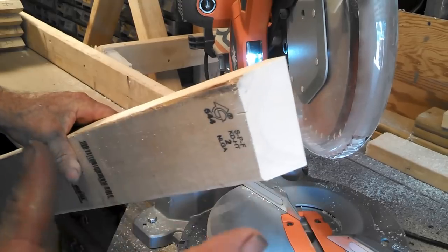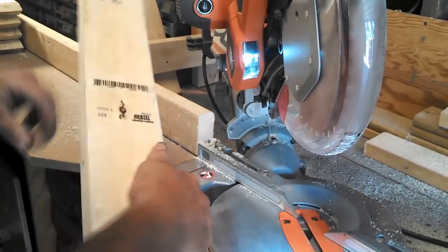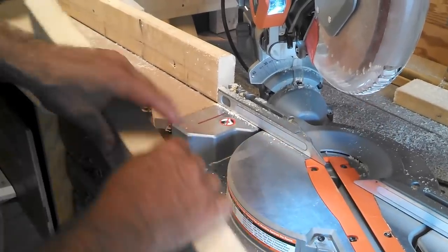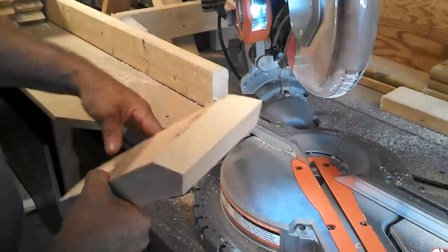That's on all of the struts except the A strut. The A strut is going to be 60 degrees on one side, and then on the other side when you cut it, it will be 12 degrees also but at 54 degrees — so don't forget that. Anyway, I just wanted to re-cut this because it's probably a little bit better of an example than the one I had before.